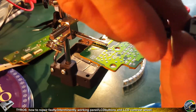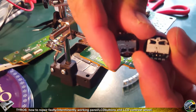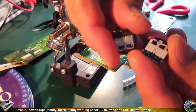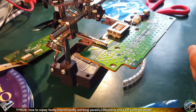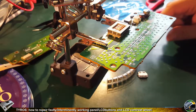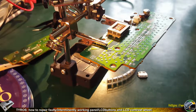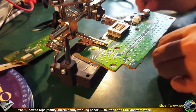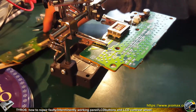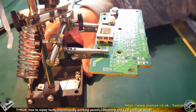When you turn the contrast wheel on your display clockwise or anti-clockwise, and the contrast looks scratchy, I mean when it's not changing smoothly, but changes by jumping from very bright to very dark and from very dark to very bright, so it's flashing, it means it's faulty and needs to be removed.